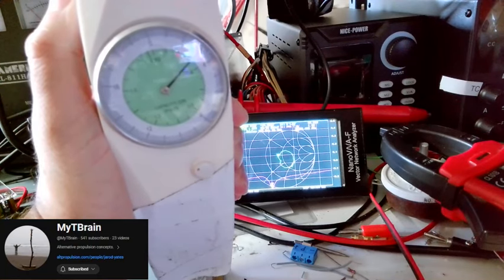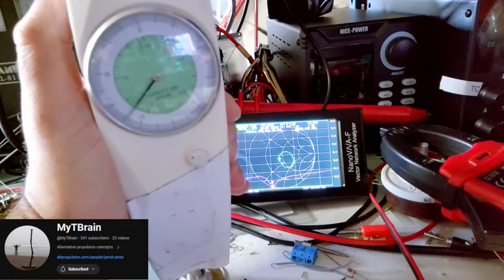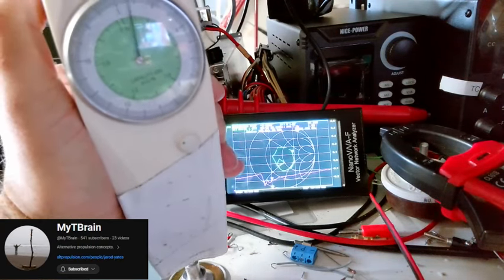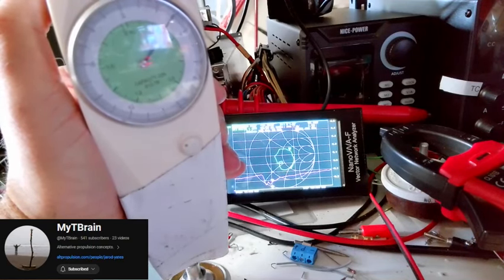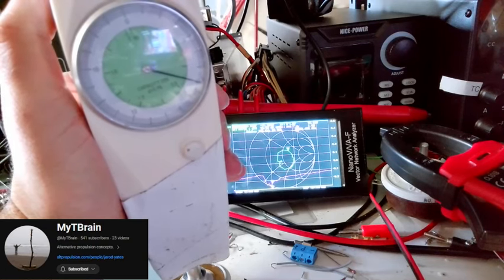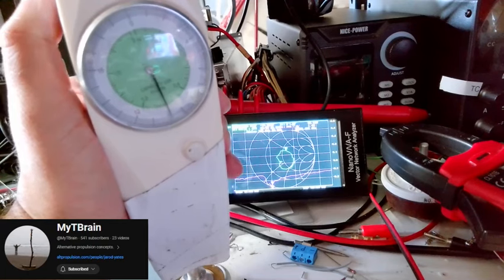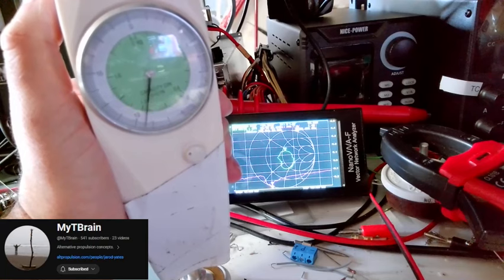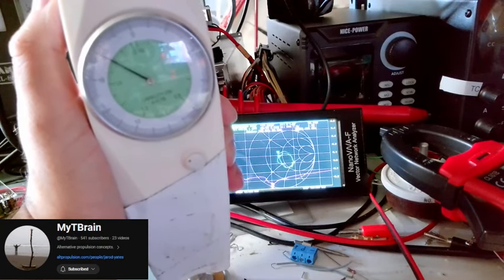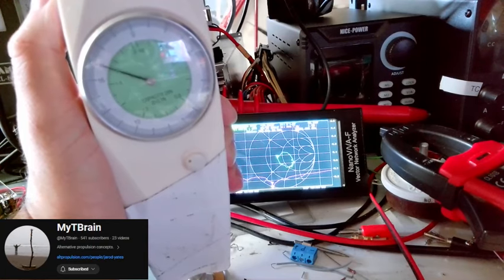The Smith chart starts getting big again as I push harder. The important part is that magenta line — as I lift up, the low spot for the SWR starts dropping back down. That low spot moves really quickly for even a small amount of pressure. At about 0.5 kilos, 1 kilo, the low spot is at 80 kHz. Where the gravifier lifts would be around 1 kilogram; 1.6 kilograms is right there, 1.8 kilograms is right there. Smoking gun.